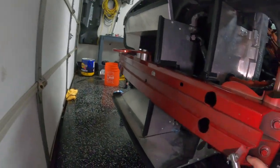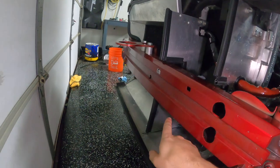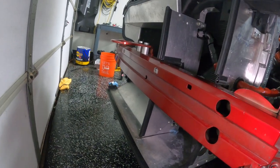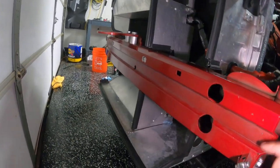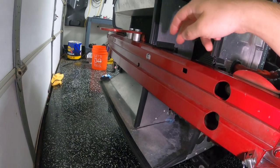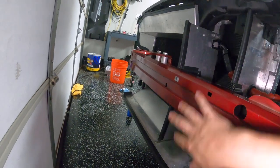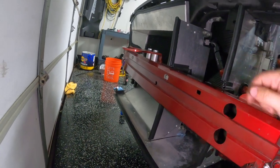I'm going to go over to the other side and do the same thing. We need to drill a hole through here to access the mounting point inside, because I'll be using a socket cap screw and a long Allen wrench socket to fish all the way down and tighten it. I don't want to fish a wrench in there given the way these are set up — this is the threaded part, so you need to screw into it. To do this, I'm actually going to pull this whole bar off — trying to drill straight through with my structure in place is just a nightmare. So I'll take the eight screws out, pull it completely off, put it on the bench, drill the holes, and continue from there.